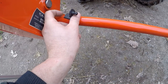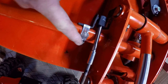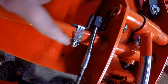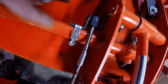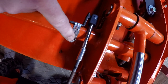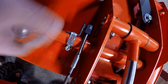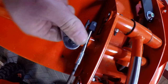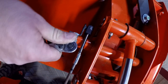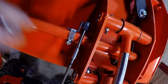I'm going to go ahead and put that on here with a hose clamp. With these pipe clamps they've got the flat head slot and they're also a hex, and I found out that you can tighten them down as tight as you can with a flat head screwdriver, but it's not really tight until you get a wrench on it — I already tightened this down with a screwdriver as much as I could, and with a wrench on here that's another half a turn or more. You can strip out this band if you go too far, but you can definitely get it tighter with a wrench than a screwdriver.